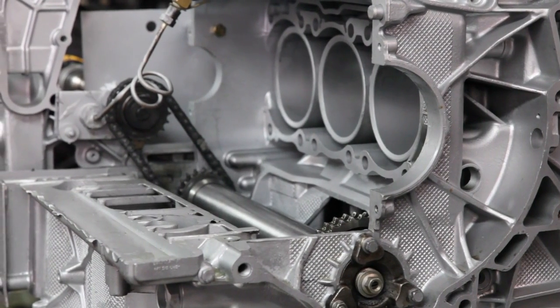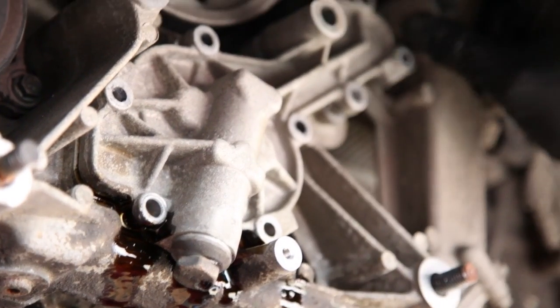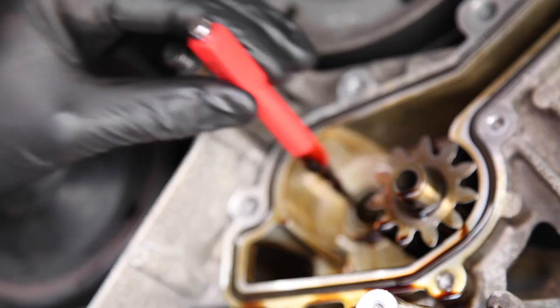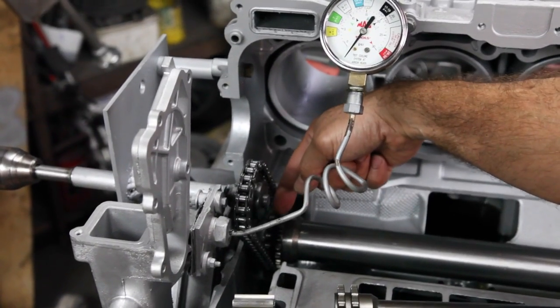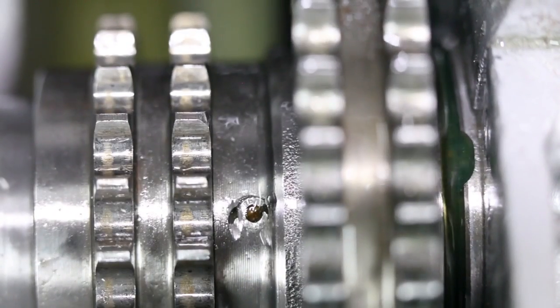This is a cutaway engine of a Porsche 996 or Boxster where we illustrate the IMS forced lubrication through the IMS shaft. The way that this is done is we remove the oil pump cover and remove the oil pump gear. We punch a small hole onto the front of the IMS front cover. Then we replace the oil pump drive allen wrench with a slotted allen drive so as to provide a passage from the oil pump to the inner part of the IMS, providing oil flow to the bearing in the IMS.